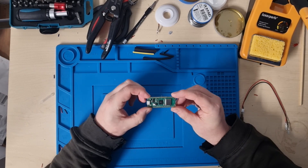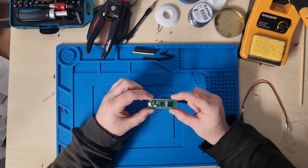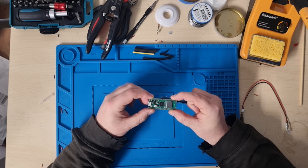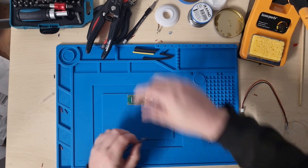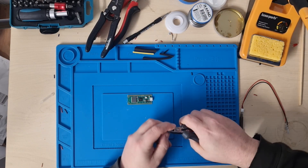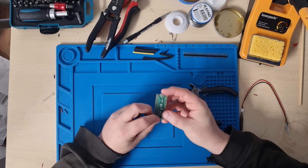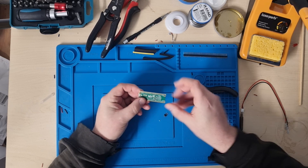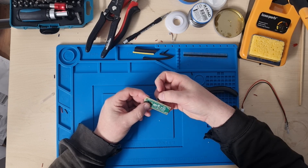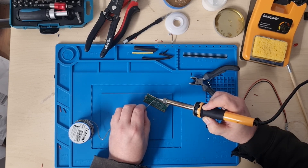This is the Raspberry Pico W — the W stands for wireless, but I don't plan to use that in this project. I've flashed the Raspberry Pico with a Pico D daemon that we need running on it, which allows us to remotely control the GPIO among other functions, but we will only use the GPIO parts here. I'll connect it to GPIO pin number six because that's next to a ground, making it easier to solder. Do not use my technique as a how-to on soldering — I'm just a hobbyist.